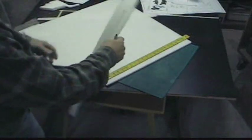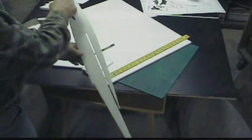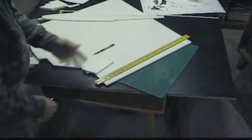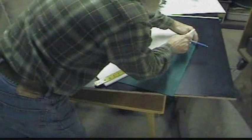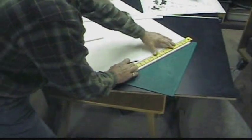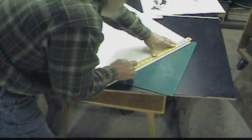You're going to need a bunch of strips that go on the inside of the fuselage to give you an increased glue area where the pieces come together. You've got one that goes here and one that goes here, on both fuselage sides. I ran out of 6mm, so I'm going to use this piece of 9mm and cut my strip square — 9mm by 9mm. That should allow me to round the corners of the fuselage a bit more than the standard.